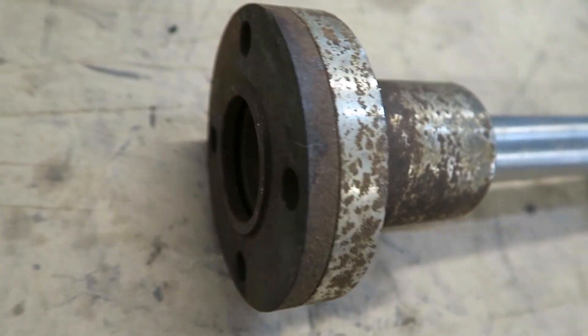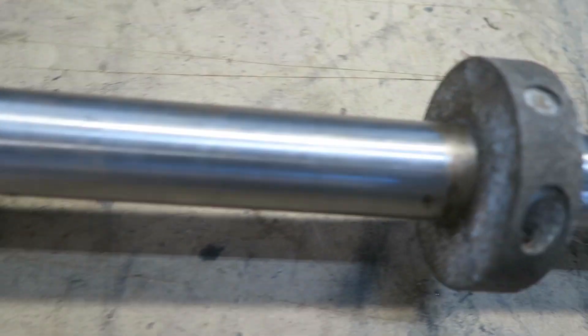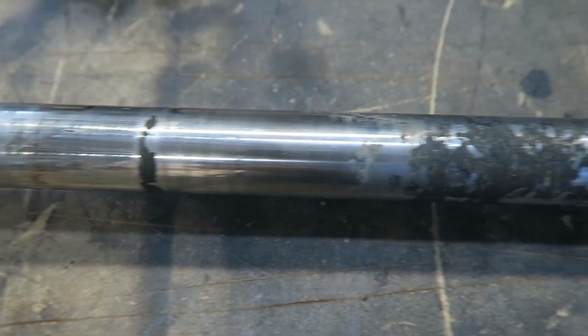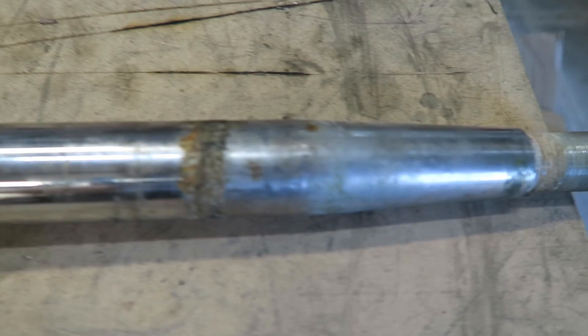The engine hasn't been running straight. When the engine is in neutral and not running, and the propeller is freewheeling, the prop shaft wriggles all over the place. Going down the shaft for a look, there are a lot of little bits of buildup.